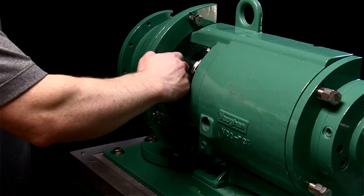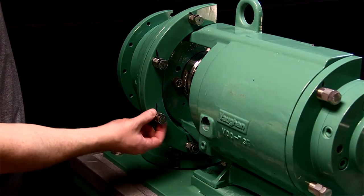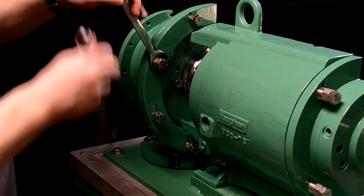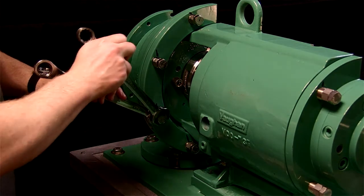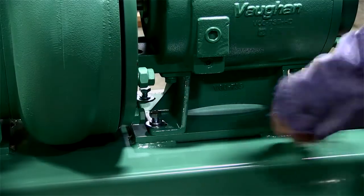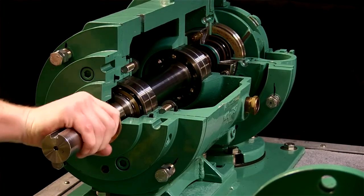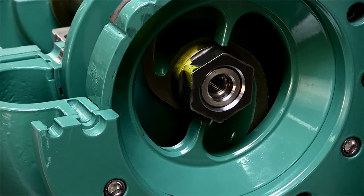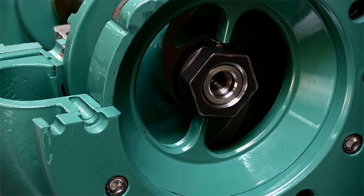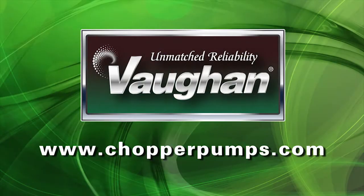Snug the unused adjustment sleeves against the casing. Make sure that the adjustment sleeves bottom on the casing and are not tightening on anything that will crush when the clamp bolts are tightened. Lock all the adjusters down with the clamping bolts and tighten the bolts that you loosened on the base plate. After all bolts have been securely tightened, check for smooth shaft rotation by rotating the pump shaft again by hand. If the proper clearance cannot be achieved or if other damage requires it, the impeller and cutter bar may need to be replaced. If this becomes necessary, refer to the overhaul manual for the proper procedures for that operation.